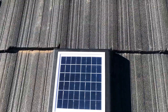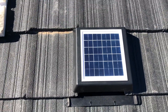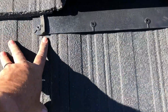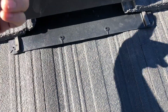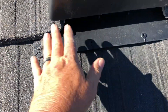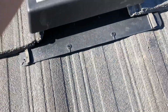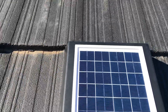She's all in. No cutting of tiles — just slipping it in between tiles. I'd highly recommend this size and this unit. It's running right now. What I'm going to do, just to be safe, is seal along that bottom edge there so air doesn't circulate through. And from inside the roof I'm going to seal between the tile and the plastic on the back — absolutely no chance of leaks. This ridge would stop it, the foam would stop it, but I'm going to put a bit of silicone on both edges just because I can and it's easy.